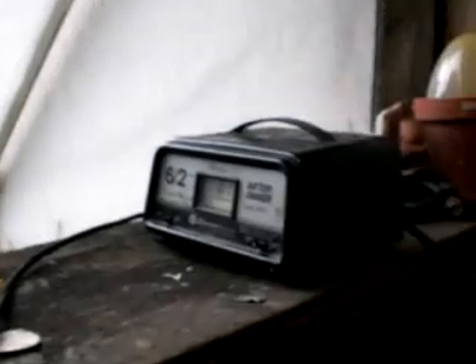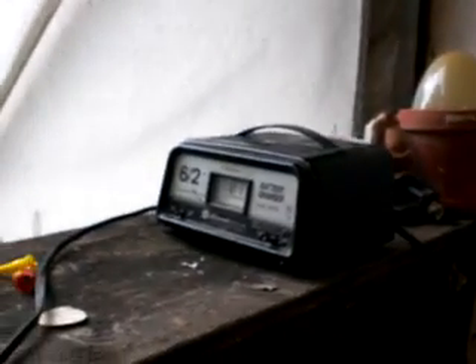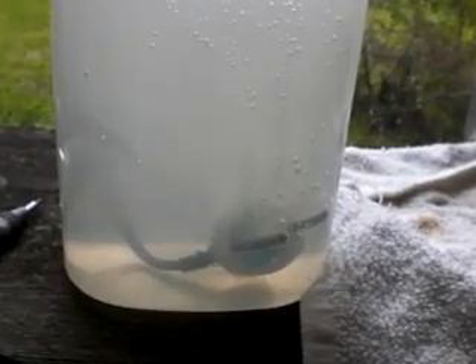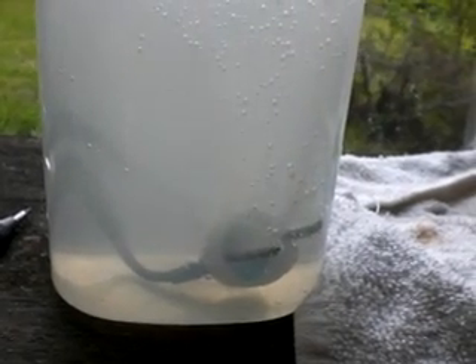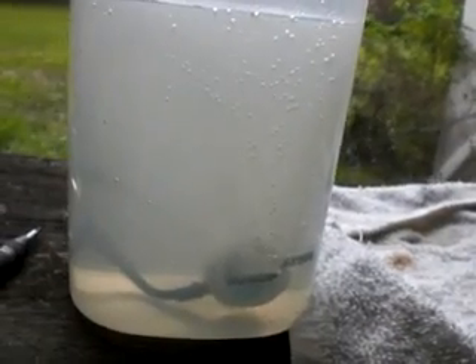This is actually brute force. I did confirm that it's definitely a half-wave rectifier — it's not a full-wave bridge. So I'm basically only getting one half of the AC cycle. I should put one of those kill-a-watt meters in line with it so you can see the total power usage, which would include the watts lost in the power supply.